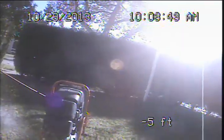Now this cleanout we found did not have a cap, and the cleanout was packed with dirt and roots coming down into the pipe, so this will need to have a proper termination cap on it. Essentially what we're going to do is drop into the line, and we're going to come out into the front yard, jog over a little bit, and run out towards the street that way. I'll go ahead and drop the camera in.